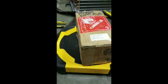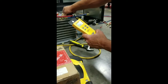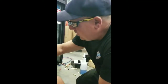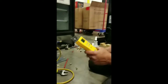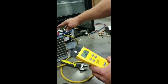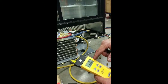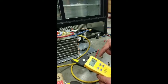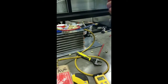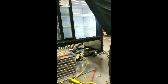Of refrigerant. We're going to have to bleed some of that out. We want to get all the air out of there. Okay, so now we know we got refrigerant to the hoses. And we really still haven't messed with this. And then I said, so there goes our gauge. So now we let enough Freon out of there.